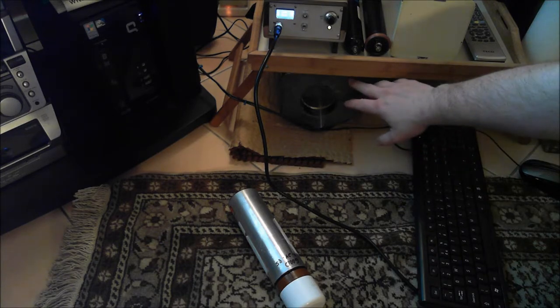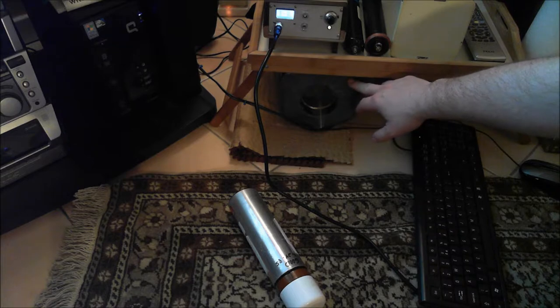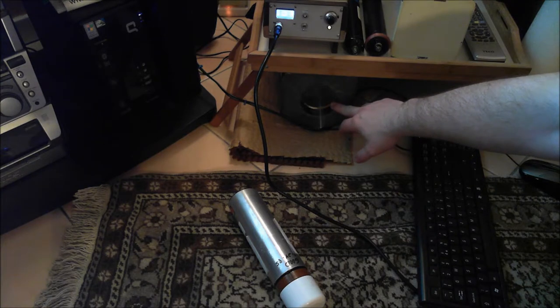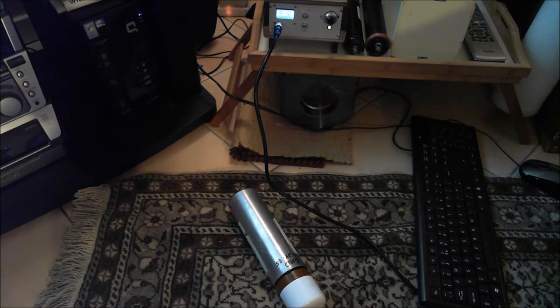I've also got a lead pig. Ideally the lead would be virgin lead and would completely cover the probe. You'd have a copper insert here, or cadmium and plastic as well, to reduce the x-rays from the lead. But even with what I call the ugly pig, it considerably reduces the background count and improves the sensitivity of the probe.